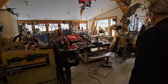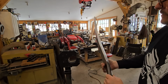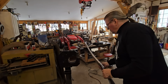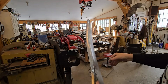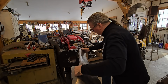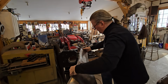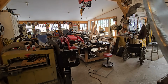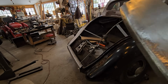All right, I've got the blades changed out. Now in this case, I want to bring this down. So I've got shrink. We're shrinking this to bring that curve down where I stretched this and opened this up. I don't want to go too crazy, but again, we'll start in the middle so I can keep an eye on what changes. And there is a little bit of a curve in that, but not too drastic. I don't want to take it all out. You never want to go too fast because then you're doing it all over one more time.